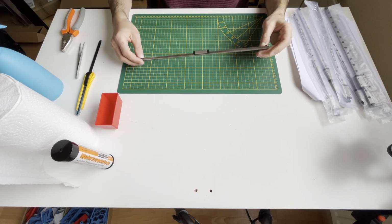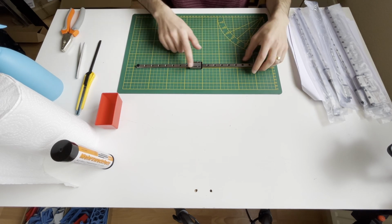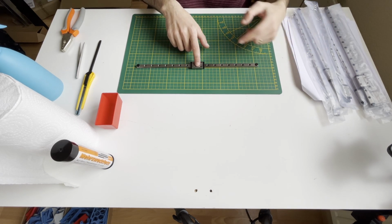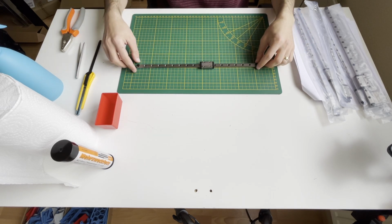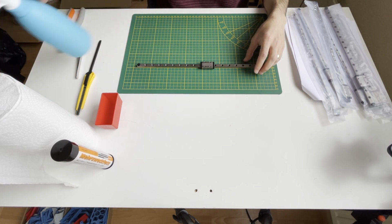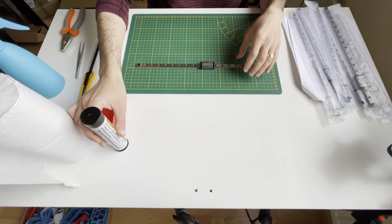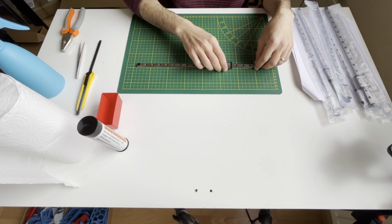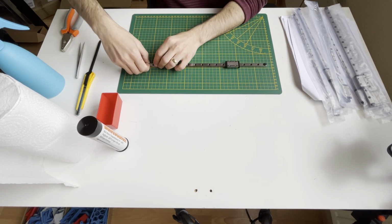First of all, the rails are actually very good quality. It's better than I expected. For now, I'm not putting pressure on the carriage. I'm only touching it when it's sliding smoothly. But the thing is, it has the shipment oil now, and I need to clean it with isopropyl alcohol, and after that I will grease them with the greaser to protect the rails and give good movement, etc. For that it has these stoppers, so I will remove this one.